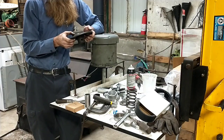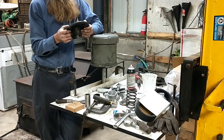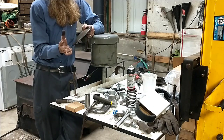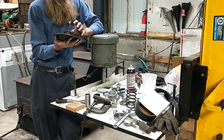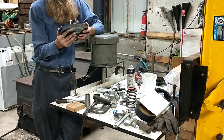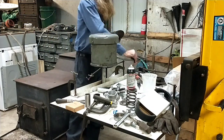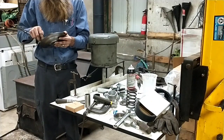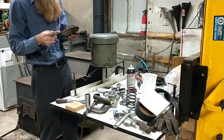And I got to tell you right now, there's a pretty high percentage of these that have at least a little bit of vibration to them after you put aftermarket bushings in. It's unavoidable. As far as I can tell, I believe that Bridgeport assembled these with their bushings, and I think they balanced them afterwards. So if you end up slightly off, it's not catastrophic to them, but don't be shocked if you get just the slightest bit of vibration that you don't remember your machine having in the old days. But that said, if you're careful doing this, you've got the best odds of it coming out good.